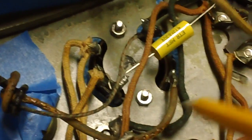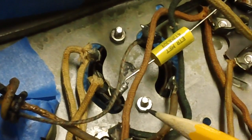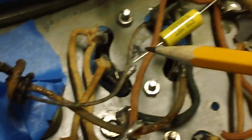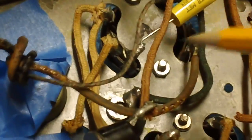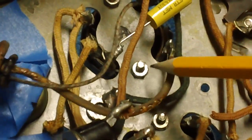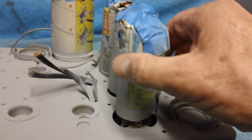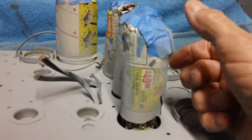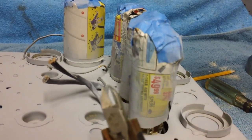Let's start our ripping and tearing by removing the nuts on these two screws right here. These screws come from the bottom of the coil and are put down through the chassis. I think we're going to have enough slack in each of these wires - hopefully most of them - to where we can pull that coil back up from the top with enough space to lean it over and get to that resistor. I may have to desolder a wire, but I'll do what I have to do. I intend to snip that resistor out of there.